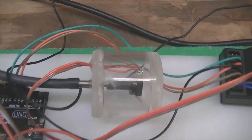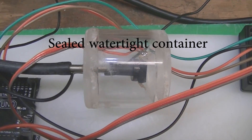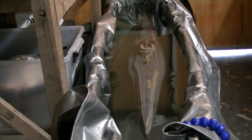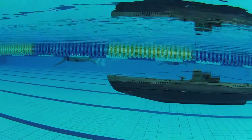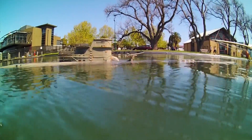I've also got the output from a little pressure gauge that sits in the bow going into the Arduino. With all of that I can make it hold its depth underwater, go through a surfacing routine and a diving routine, and control it much better.